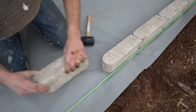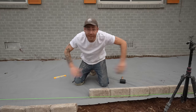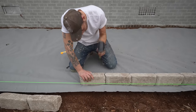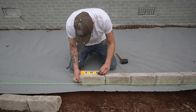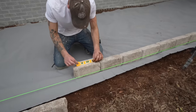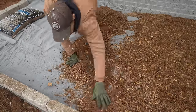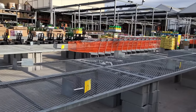Now let's lay down some edging pavers. I'm using a line to lay out cement blocks — we've got a lot of play with the margins, it's just to keep me on track. I build up dirt under each brick, compact it down until the two bricks are level, adding more dirt than needed so I can compact it back down. I'm using cypress mulch for the color and it has the added benefit of not floating — it stays where you put it. I was shocked to see that Lowe's and Home Depot both had no plants — I guess there's still one more freeze before spring.